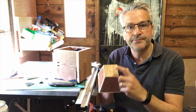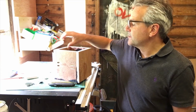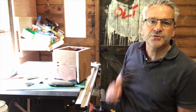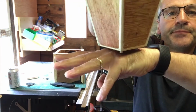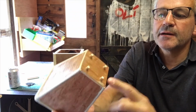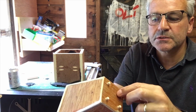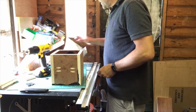Okay, so next step is to do those 2 little dowels, get that set up, see if I can do a silicone mould pour. This stuff feels as if it's pretty secure. Yeah, that's all good. Okay. So I've added the 4 little dowels that will sit inside the mould, so that'll raise it up. Those will also become the pour holes and the breather holes when I actually go to start pouring the lead. So I'm ready to start mixing a mould.